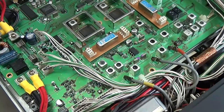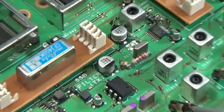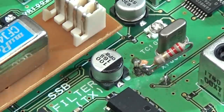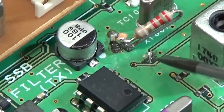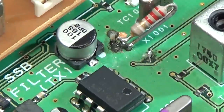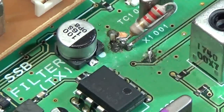Well, and by saying a good starting point, we did some further inspection. So what do we have down here? What you clearly see is that down here on the board there is a through-hole resistor, which should not be there, right? And what you can see as well is that we have board damage here. And of course, have a look. That here is really not good. Normally we should see an SMD part over there, and I do not have an idea why this has been done.